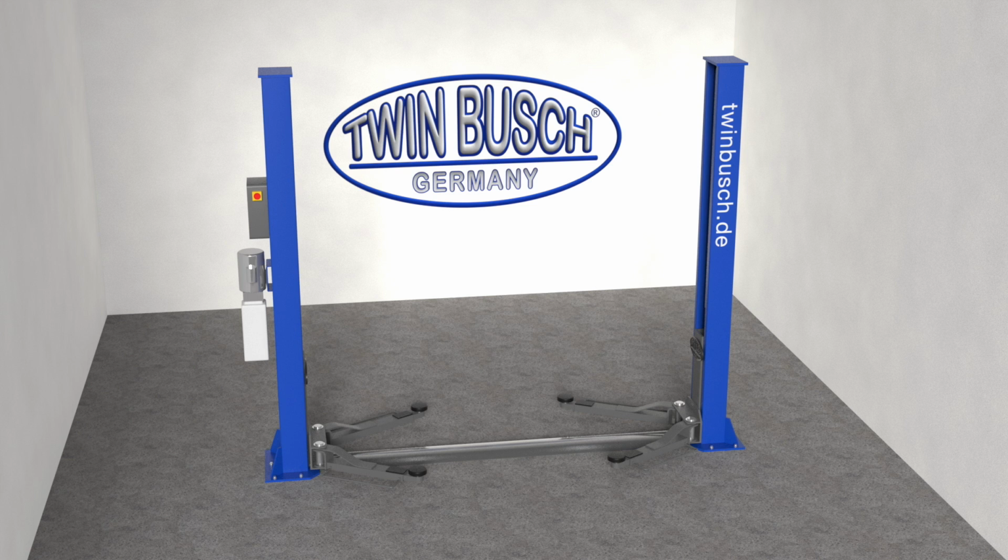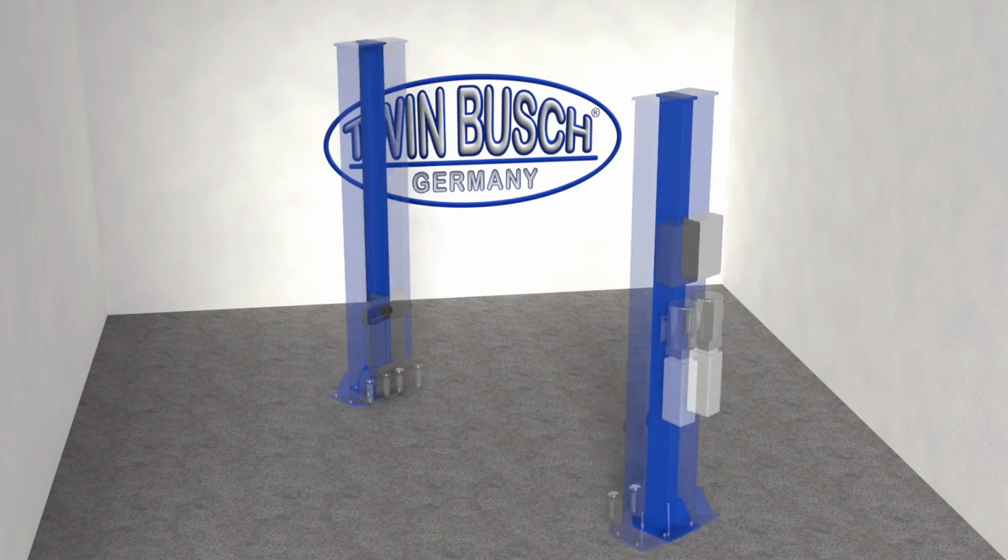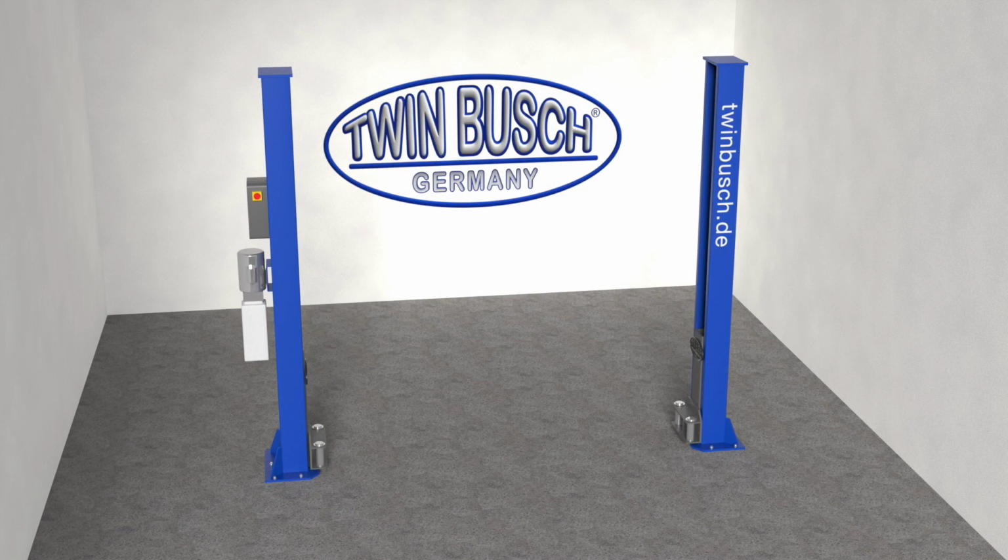Before beginning the assembly process, you should consider the position in which you will be placing your TWIN BUSCH automotive lift. First, you will want to decide where you would like to position the main column that houses the control and motor unit. Keep in mind, the position in which you place this column is where you will be operating your automotive lift. On this side, you will need some space for operation.